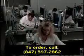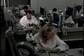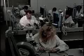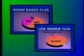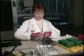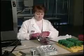This program has provided information on what is required for hand soldering using low residue fluxes. You've seen that it is very similar to soldering with an RMA flux. It may help to review the areas where additional attention may be helpful. Low residue fluxes have less solids and the activity period may be reduced. This means that the time available for low residue fluxes to break down oxides is less than RMA fluxes. More attention may be needed with the handling and storage of solderable materials when using low residue fluxes. The odor from low residue flux fumes may be different from that of RMA flux.